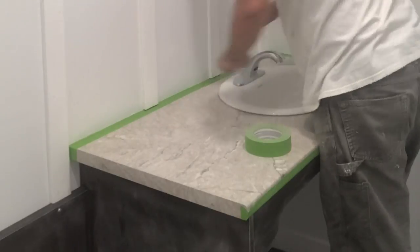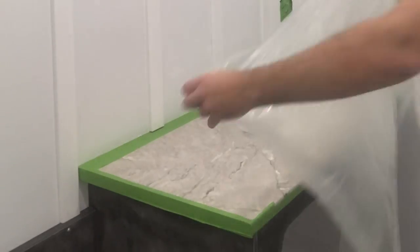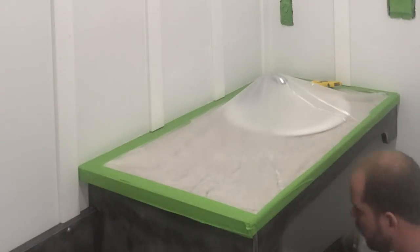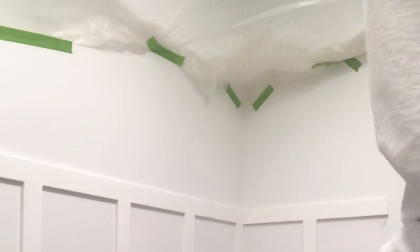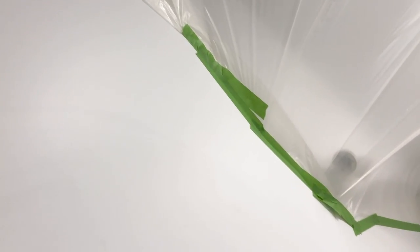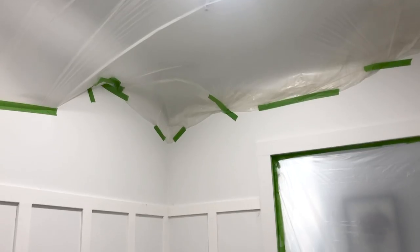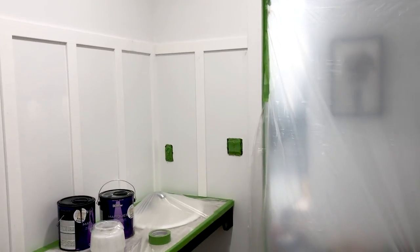Now that we know all of the great features, we'll go through all the prep work we did and how we actually used the paint sprayer. The first step anytime you're using a paint sprayer is to tape off all of the parts of the room that you don't want to get paint on. In our case we were doing a bathroom, so we wanted to tape off all of the fixtures and the plumbing, as well as the ceiling. We were planning to wallpaper above our board and batten and put new flooring down, so we didn't worry about taping off those two areas. There is a lot of overspray when using a paint sprayer, so if you're working inside you do have to make sure to protect the whole area. We used drop cloths from our local dollar store and some frog tape to make sure everything was sealed off.